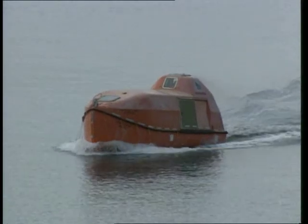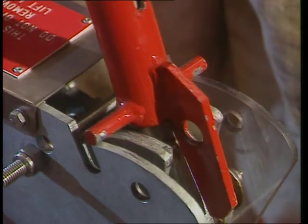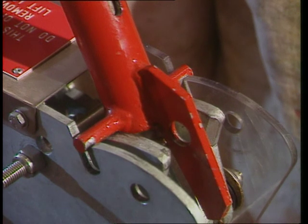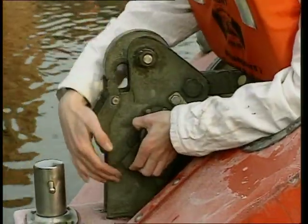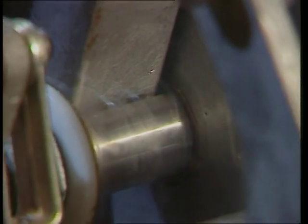Once the drill is over, before returning to the ship, make sure the release handle is pushed back as far as it will go so that the locating pins in the handle are above the slots. Reset the release hooks, pulling on the lever until they reach the stop position, with the tail of the hook hard against the flat face of the cam.